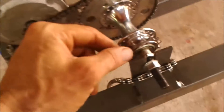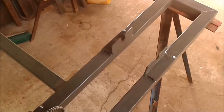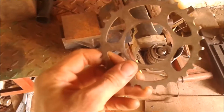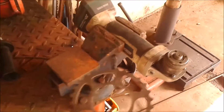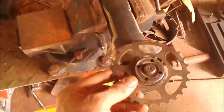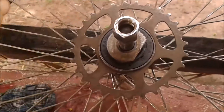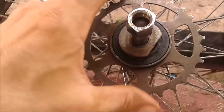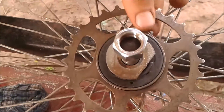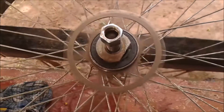I need to put in the derailleur here. Now I'm working on this side — got this set up and welded on a little 13-tooth sprocket there, and now I'm working on the sprocket from back there. I'm trying to widen this here — this is not really the ideal die grinder setup, but I turn it on, hold it with two hands, and try to grind that up. The grinding results in something like this, and this thing fits on here now. I think I'm going to try to just use some bolts to clip it in place rather than weld it, to see if this is the right gearing or not.